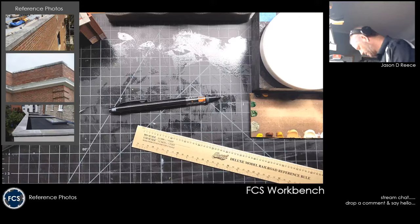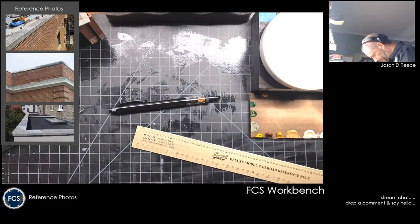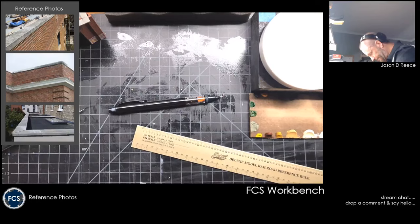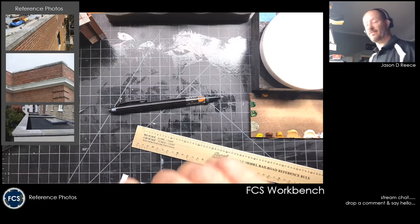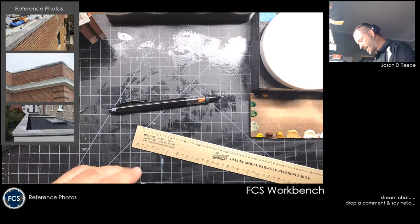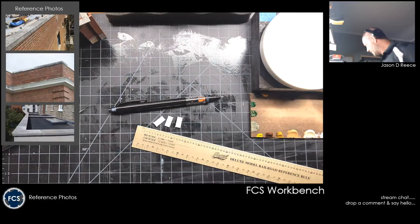Can't get this on screen. Cut some stuff. Thing about this is they actually don't have to be all perfect, because we're not going to glue them in place to the roof yet. We're gonna build the pipe supports, and then we're gonna come back, and once we have the pipe support rack, we can level up the top and then set them down into those steel beams, and then that way we've got some adjustments that we can do there when we're working with that.